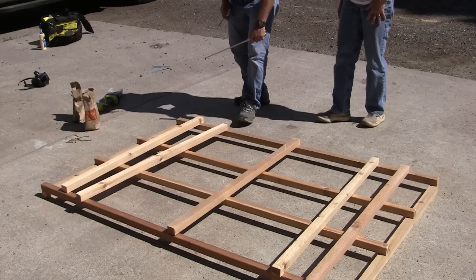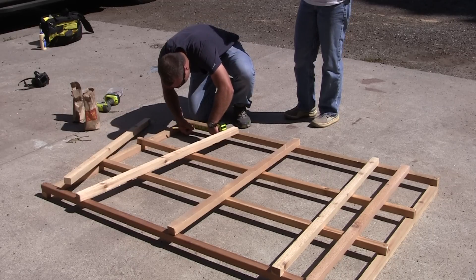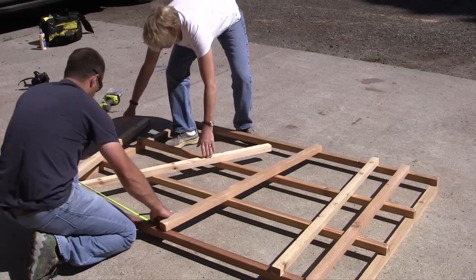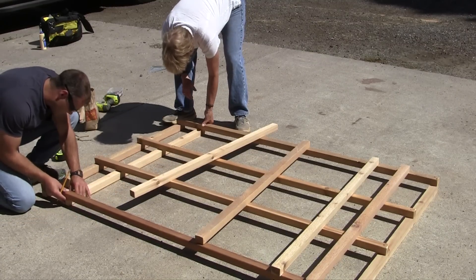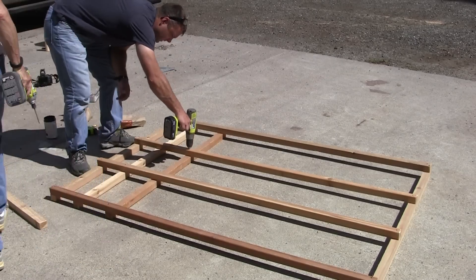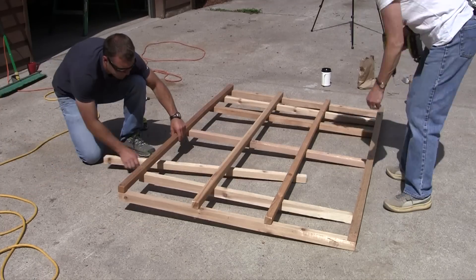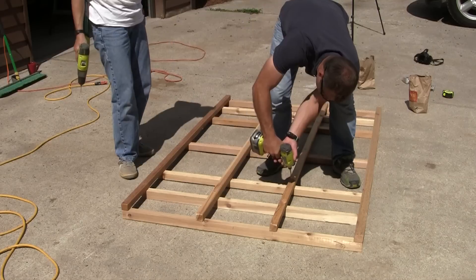We'll start measuring — going first from the very bottom and marking on the side since we're attaching from underneath. When you've finished measuring, we can start attaching the shorter 48-inch boards one at a time. You can attach them using one screw at each board, and you're welcome to use wood glue if you'd like. Continue attaching each of the horizontal boards to the trellis — you can space them however you'd like. We put one just below center to attach a horse trough planter, and the others near the bottom and top where we'll eventually have some vines strung through them.